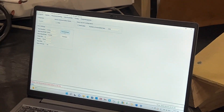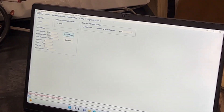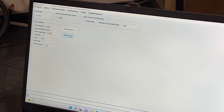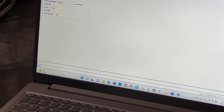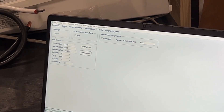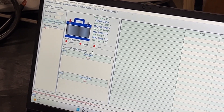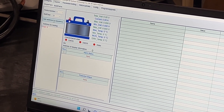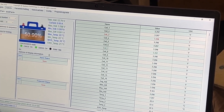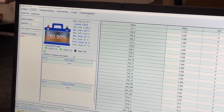With this cable, we've gone ahead and connected to the battery. We're going to hit port refresh just to make sure we can connect, and then click on the connect button. If you successfully connected, you'll see at the bottom 'port opened successfully' as a flashing message. To verify, I always like to go to the bat info tab. We're going to change the address to zero and add address to sequence — you'll see the battery's state of charge, loads, and voltages. For updating the firmware, it is required that you're on port address zero, so ensure that you've got that set up.